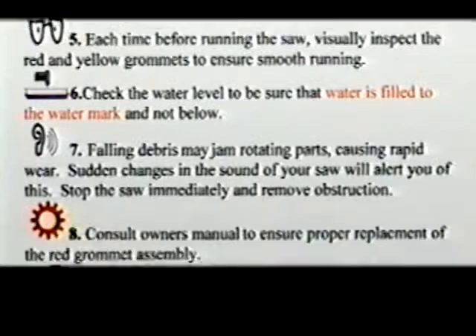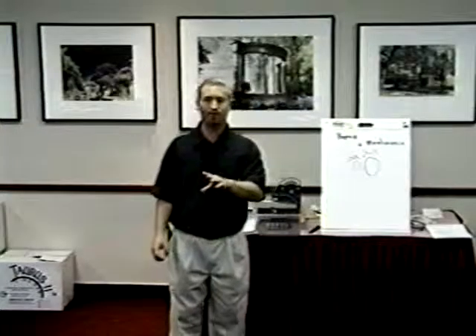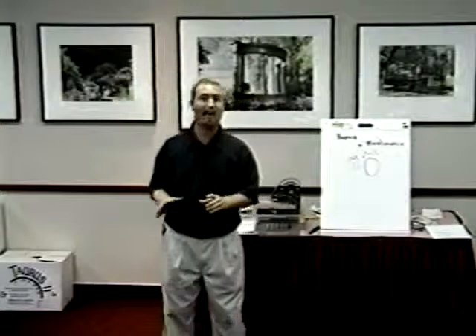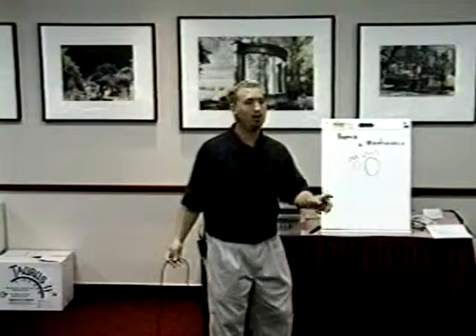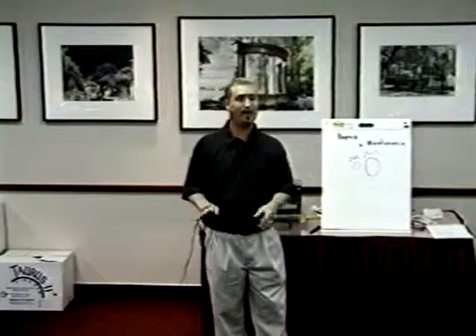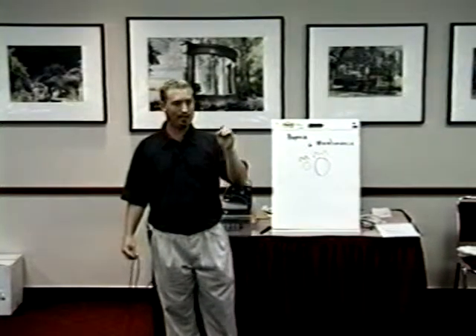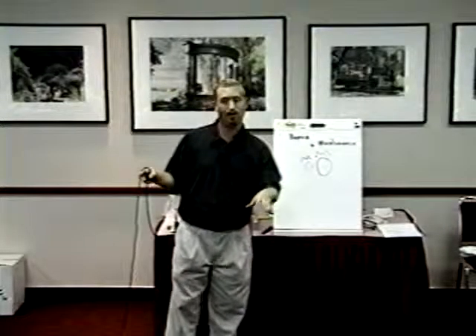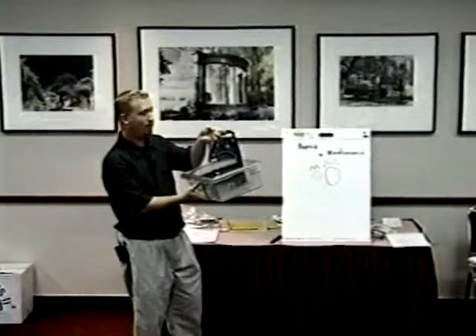Common sense — we find a lot of people turn on their saw because they're excited, but they don't have any water in it. There's a lot of friction going on and the saw needs water. If you turn it on without water, it won't last long before you start burning things up. Also, a lot of people use these in garages with unlevel tables. They fill it to the watermark, think everything's okay, flip it on, and the pulley isn't touching water — so they're burning it out. They got it right up to the water level, but the saw is tilted forward, so they don't have enough water.